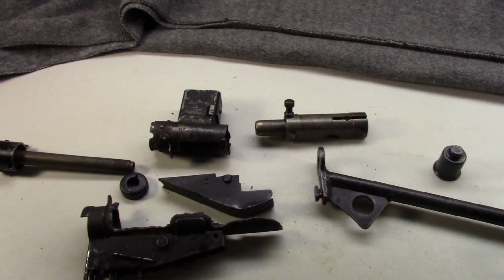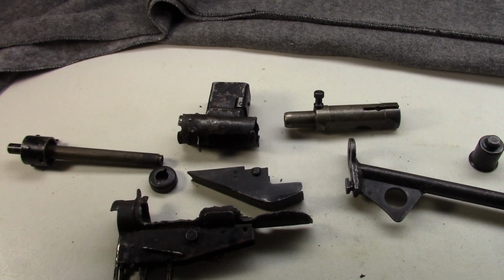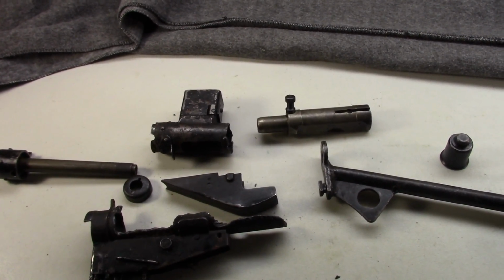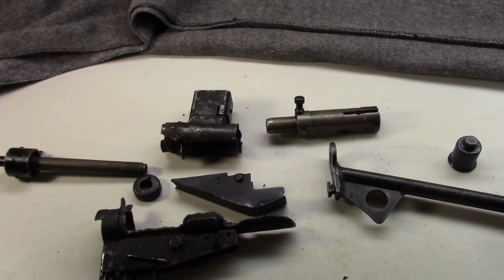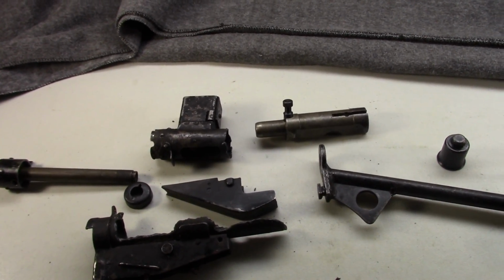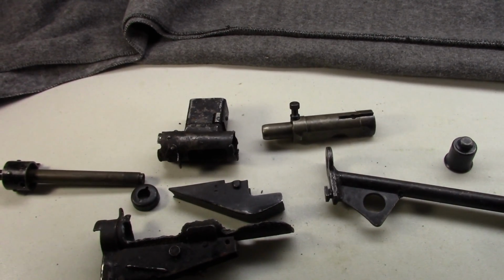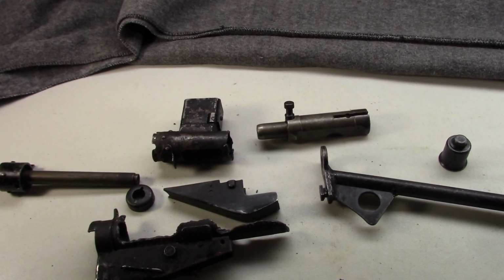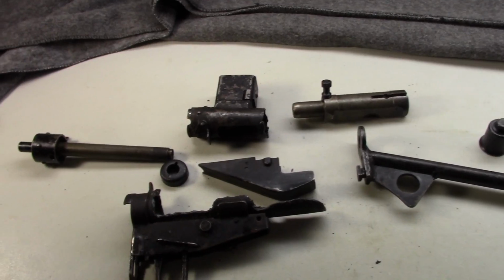Just not a fan of a lot of the US tubes, especially the quote-unquote 80% ones that come with the little stick-on template. They tend to be very heavy, extra thick, machined metal. Instead of doing the reduced diameter tube, I'm much more of a fan of doing a blocking bar, kind of like what was done with the Sterling in the 80s, and of course the Uzi. That way you can keep the original lighter receiver and more original functionality.